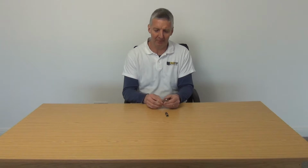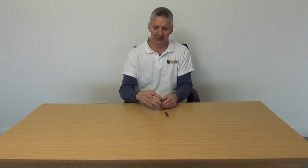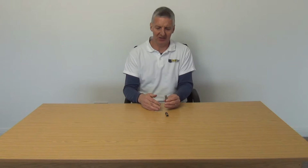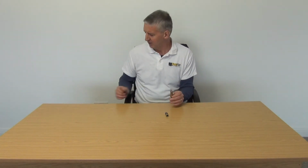But when you have the bottom part pushed up sufficiently, it will push the center of the pin so it's actually flush with the top of the pin here. That's a very good indication that I've inserted the cable sufficiently, because at the cost of these connectors you don't want to do this wrong. So you need to have a special tool for it.